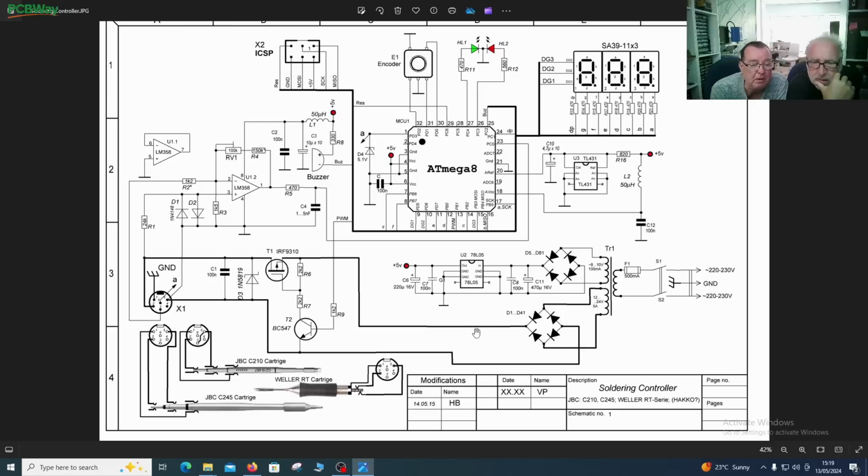Again, guys, why is this guy using pulsed DC to drive the heating element of the iron? From D1, D4, you will get an upflipped sine, at 100 hertz or 50 hertz mains. Why is he doing that? Do you guys see any reason why I couldn't use something like a 24 volt 5 amp power brick type thing, or a 19 volt, or even a PD?